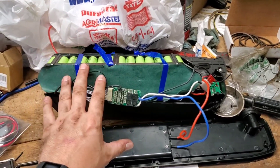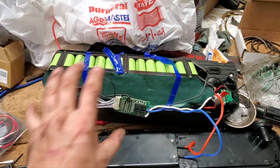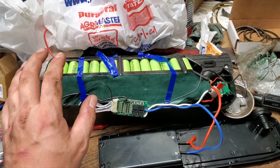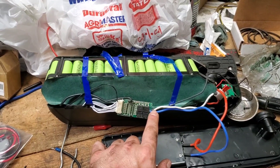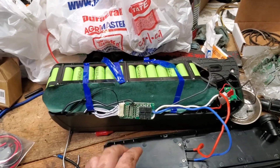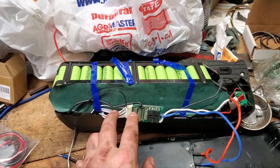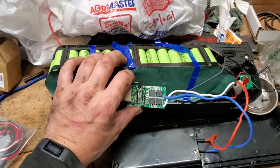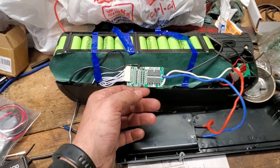I wound up taking the battery pack apart and tested to see where I was at. I did find 36 plus volts in here, so it did take a charge last time I put it away. But testing here, I got 36 volts on one side and only 31 volts on the other. Right here is my charging circuit. I dilly-dallied around with it with my multimeter, testing different chips and voltage at different locations. I have 36 volts in certain spots, 31 volts in others. I didn't see any cold solder joints, but we do have a lot of surface mount stuff on here, so I'm not quite sure where the problem is — but something is wrong in this board.